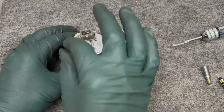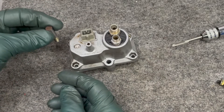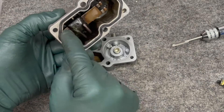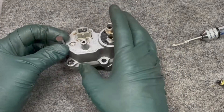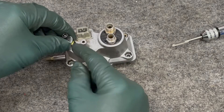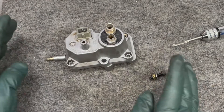Here's the pin — you're driving this pin down, and if you drive it too far you'd have to take the unit apart and tap it back up, then reassemble and tap it back down. But with the adjustable version, you can tap it down and if you go too far you can use a nut and tighten it up — it acts like a puller to pull the pin back up. So I've decided I am going to do the adjustment on my other WURs using this approach.